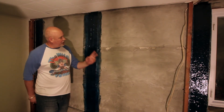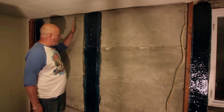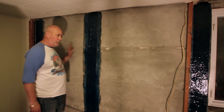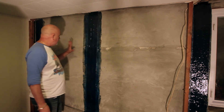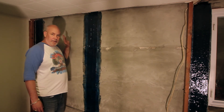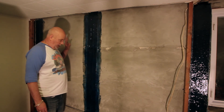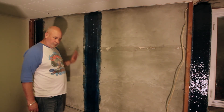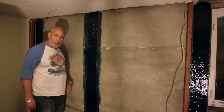As you can see, we've got our three carbon fiber strips on this section of the wall. We've double coated everything, placed them four feet on center — one, two, three, and then a fourth in the corner — and this will reinforce this block wall very well. The wall's not failing now, but the people are getting ready to frame this up. We're going to let this dry, come back in, and then paint this wall white to make sure it's fully waterproofed.